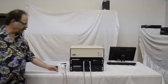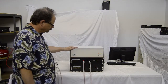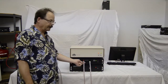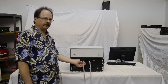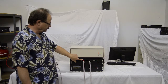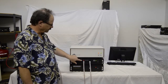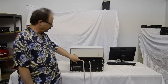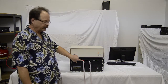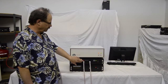The last thing I would say is: when making a high voltage measurement, whenever there is actually high voltage at the HV return port of the front panel of the HVI, the high voltage enabled light will illuminate. When high voltage is not present, the light will extinguish. The lamp may extinguish and illuminate repeatedly during some measurements, but when the measurement terminates, there will be no voltage available and the light will be extinguished.